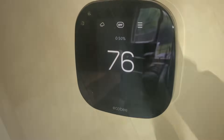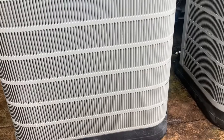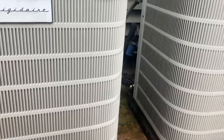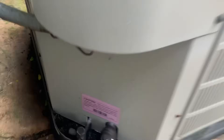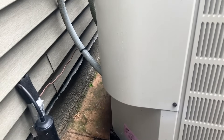Where's the thermostat? The thermostat's right here. All right — 76. Let's cool and lower a few degrees. Let's go see the outdoor unit. It hums. It doesn't always happen in the beginning, maybe like in the middle. Frigidaire. And the other thing I noticed is that when I put my hand in the middle, it's just warm — it feels like ambient temperature. What do we have here? We have a four-ton Puron system. Humming, a little bit worse.